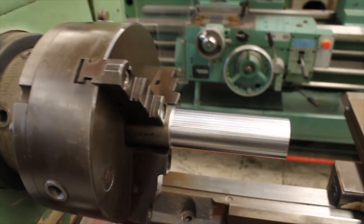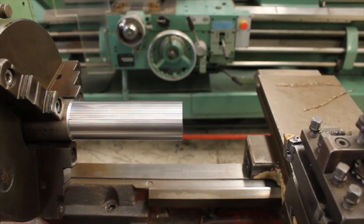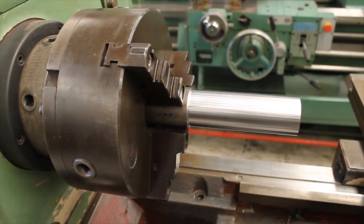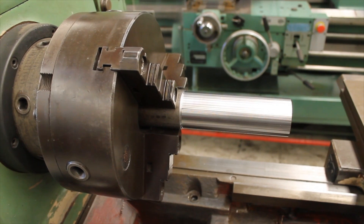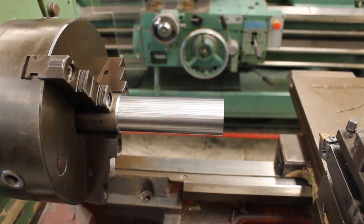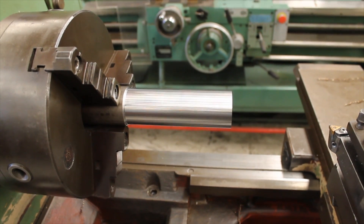I'm just taking a sample cut on the lathe and I think we can see it's produced a very, very good finish. I've just measured end to end — it's about six inches and there's about half a thou of taper between the two ends. I might just stop the camera and then start again and do another cut.